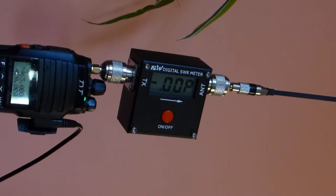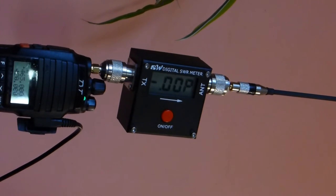So what we've ended up with here is the tuned antenna shows more forward power. The OEM was 6.1, this is at 465, the tuned at 7.8. At 420, the OEM was showing a forward power of 7.8, whereas the tuned was showing forward at 9.8. On the reflected power, we had less reflected power on 465 from the tuned antenna, and it was a little more at 420, which would make sense because that antenna is not tuned to that. Also take in mind that that's a quarter wave. I'm not sure what the longer whip for the dual band is. Velocity factor would be about the same for both of them.